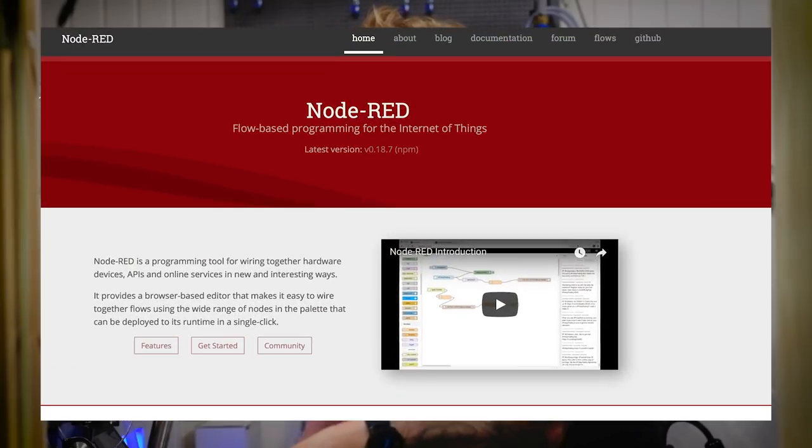And it didn't take very long before he actually had a test available for me. With the help of Node-RED as a kind of middleman, I was able to send the recipe from Brewfather into Node-RED. Node-RED converted all the fields I needed to Modbus commands, which is talking to my Wago PLC.